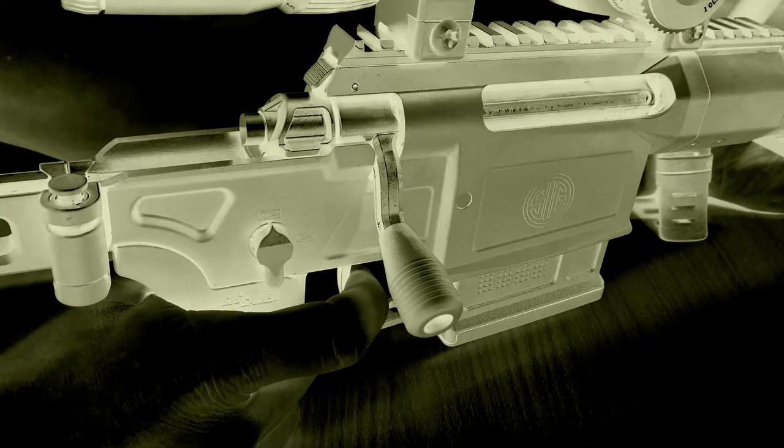Firing. With the bolt locked and the safety selector lever disengaged, the Cross can be fired by pressing the trigger. Pressing the trigger rearward rotates the trigger bar, releasing the sear. The sear is cammed down by the pressure from the main spring-loaded striker assembly. The striker assembly is driven forward under spring tension to strike the primer of the cartridge loaded in the chamber, firing the cartridge.